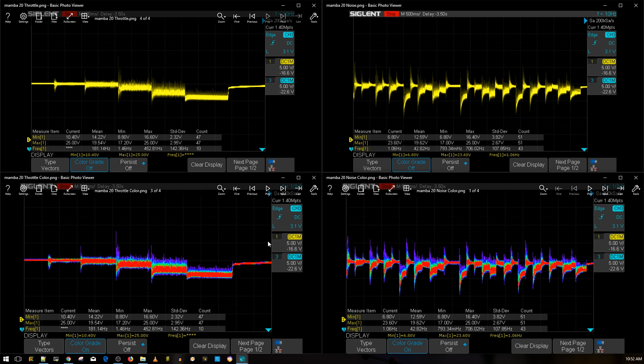The 20x20 stack does have a bit of filtration — the 30x30 basically has none. I think you could get away without a low ESR capacitor if you're using small motors on the 20x20, but I highly recommend you just plug in that capacitor and enjoy your quad without having some weird issue happen on the field and spending your whole day debugging.